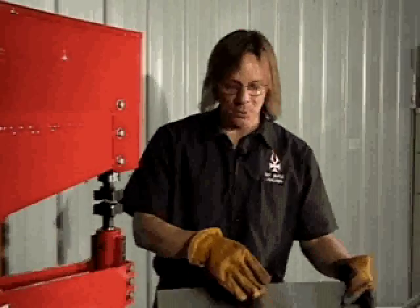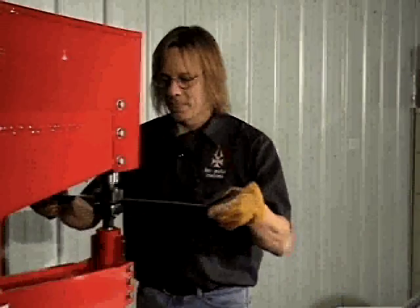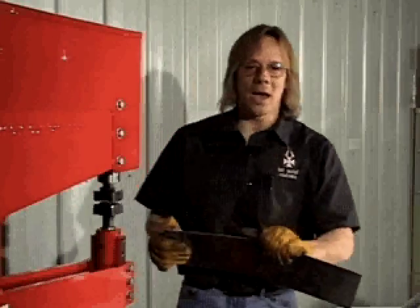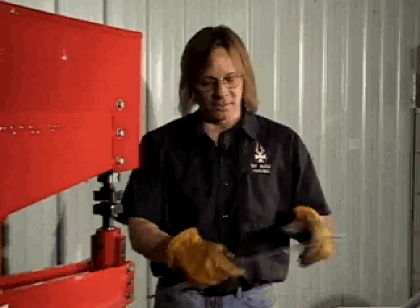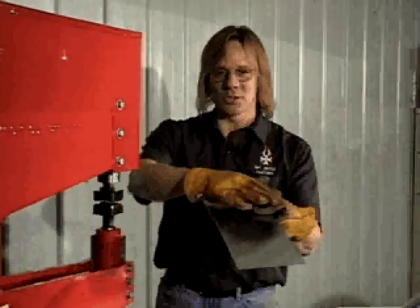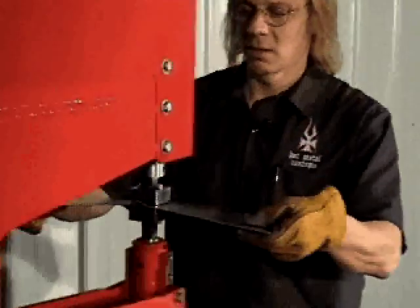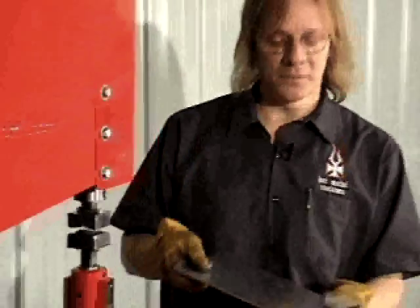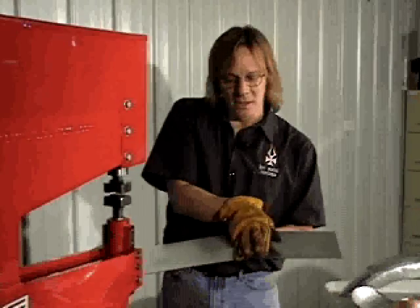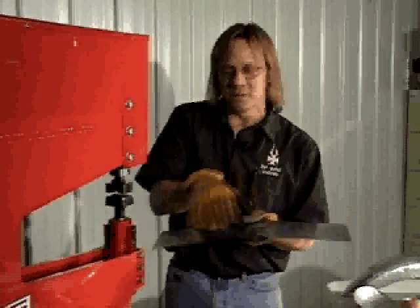Here's a simple part, and let's say we want to shape this metal. There's one pass into and out of the dies. It may not seem like much, but we're actually starting to get a compound shape. Let's see how that puckering technique we described earlier actually works by just going in and stopping. Here you can see the pucker that the thumbnail die does. It draws the metal in, and then on the way out, it holds the sides and pushes it down.